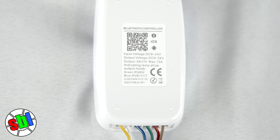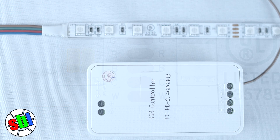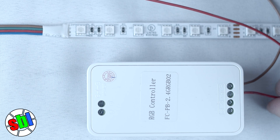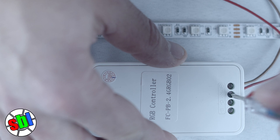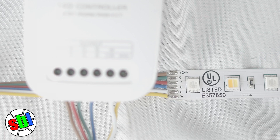Next, we're going to discuss what some common issues are that people have with LED strips and controllers. You must match the power supply voltage to the voltage of the strip, either 12 or 24 volts. The product specifications are printed on the strip. Most times, it is easy to wire a strip to a controller, but there are some critically missed steps in the process. Installers sometimes only rely on wire insulation colors for proper wiring. You should always look at the printing on the strip and follow that wire to the controller.